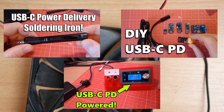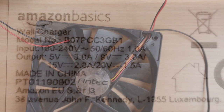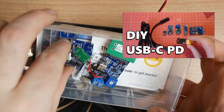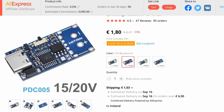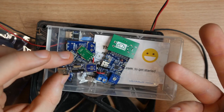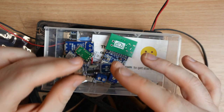I've talked about USB-C power delivery in a few videos in the past, but just a quick refresher: it's a standard that supports multiple different voltage levels where the device connected to the charger actually negotiates with the charger which voltage it should supply. What we want to do is use one of the decoy modules I talked about in a previous video to request 12 volts from the charger. For this project I'm going to use a module based on the IP2721 — just note there are two versions: one that does 15 and 20 volts, and one that does 9 and 12, so we're using the 9 and 12 one. When you plug this module into a charger it will automatically negotiate 12 volts if supported; if not, it will fall back to the next highest voltage the charger supports.